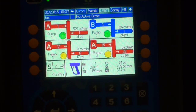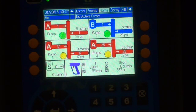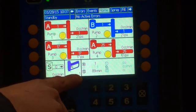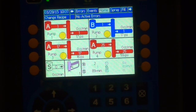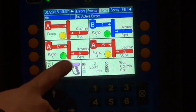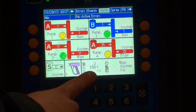So let's say he shuts down, now he's ready to switch colors. He's currently loaded and everything, but you can see from out here that he's switching colors. So he puts the gun into standby, but it's still purple at this point because it's loaded with color 1. So let's say he's moving on to color 2. It shows here that he's going into color 2. The gun turns light purple, which means he's about to flush. If you watch during the flush sequence, you'll see it count down. The gun slowly begins to go down, and at that point now he's completely empty. There's no colors loaded, and he can go straight into color 2. Now he's ready to mix material and get into his ratios. Over there it shows you that recipe 2 is 3.5 to 1.